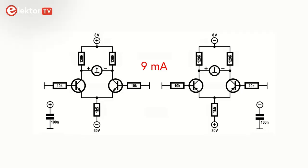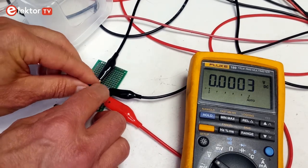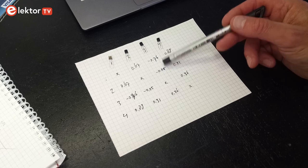For the second differential stages you must use slightly different circuits with different power supplies. Repeat the previous procedure for both NPN and PNP pairs. When all the transistors have been compared this way, you can select the best match for each differential pair and keep them together.